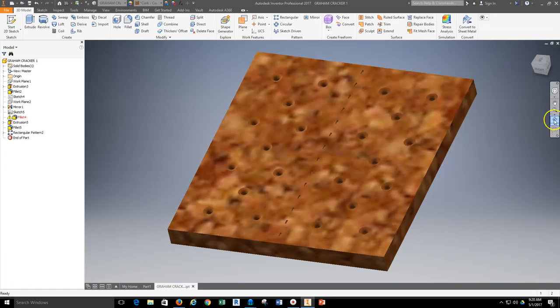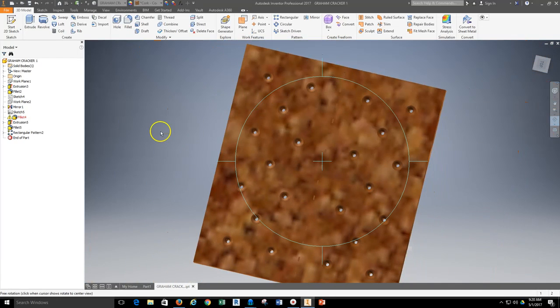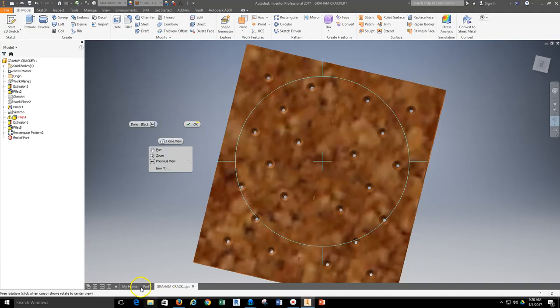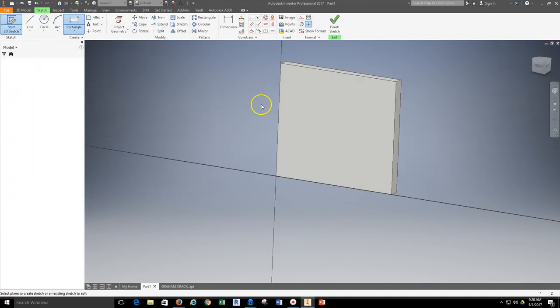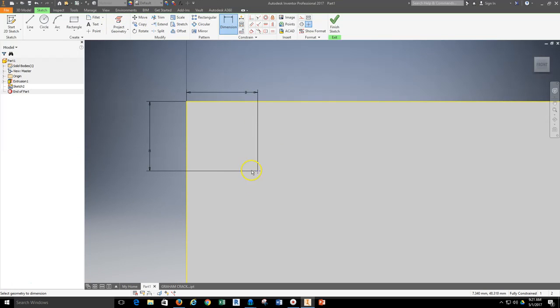Looking at the actual solid graham cracker we made, the holes are a representation of the indentation and the hole and the fillet that runs around there. I'll go back and look at the drawing — we have this hole pattern, it's an 8x8. I'm going to create one hole first, set up the offset for my 8x8 using a point to locate the hole, dimension from this point to the outside edge and drop that as 8 millimeters, then do it again from this side. I could have used the linear tool with the hole tool, but this shows how you can use points and sketches to set up hole locations.